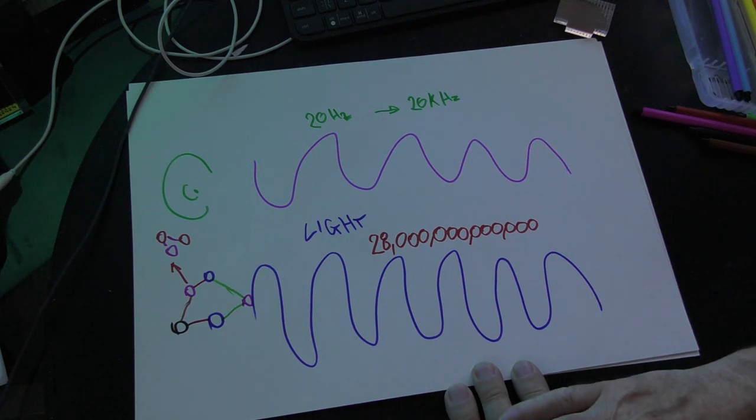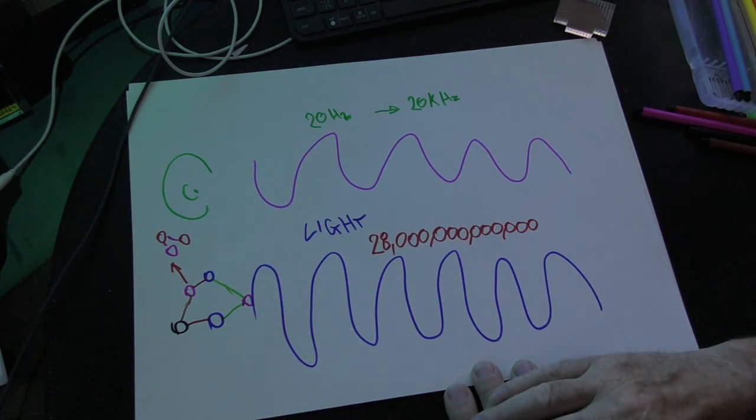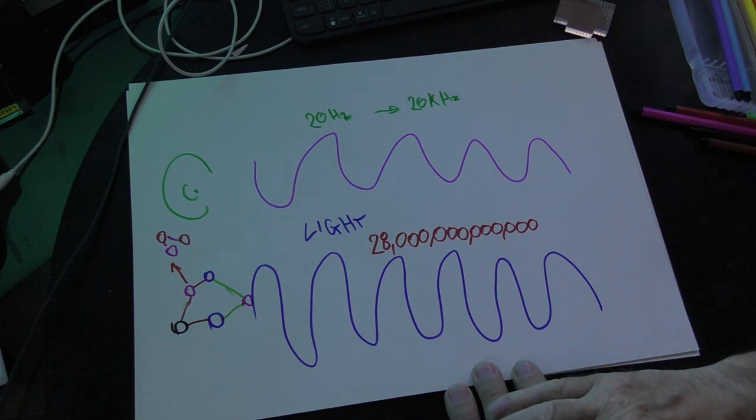It has to work from the surface in, molecule by molecule by molecule. The only reason I could drill those deep holes in acrylic was because there was light getting right down to the bottom of the hole and evaporating the material, stimulating the molecules. And it's nothing to do with focus. Yes, focus focuses light, but if you remember, we put unfocused light onto the surface of the material and it drilled a hole with a point on it.